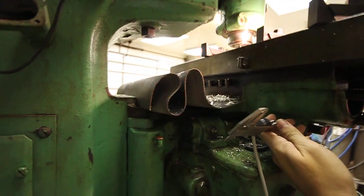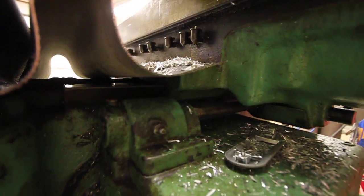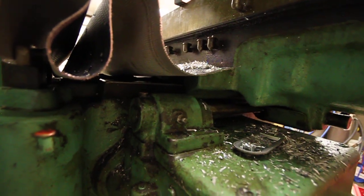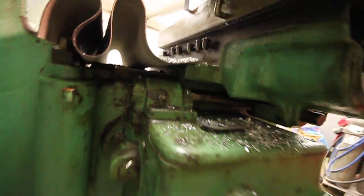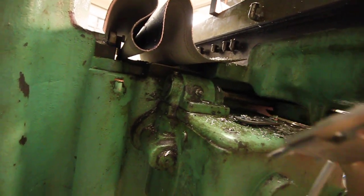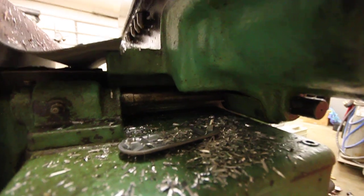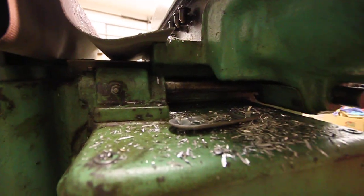Basically I could mount the scale like this and it would fit the underside of that dovetail section on the table support. The reader might actually fit back there. Actually, looking at the size of this six-inch caliper, I might not even have a problem — I might be able to just mount it flush with the knee saddle, I guess that's what it's called.